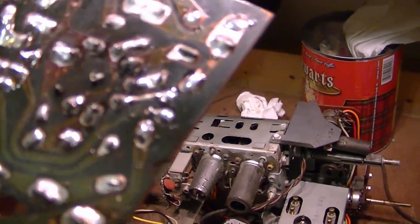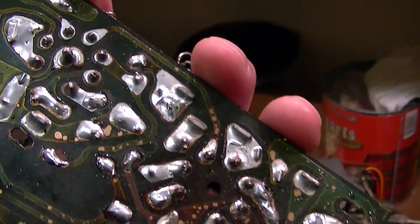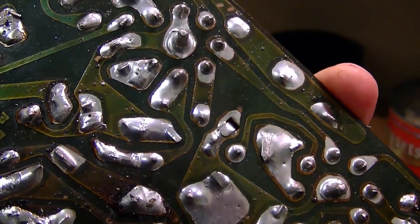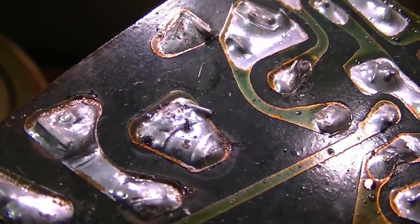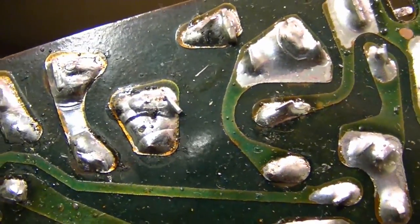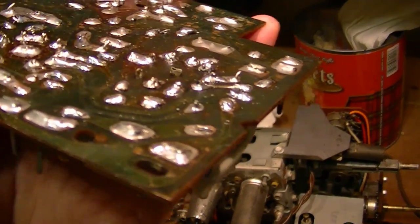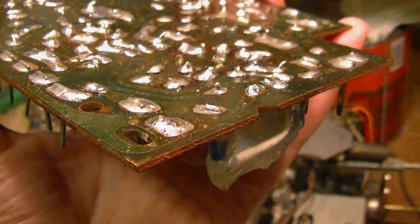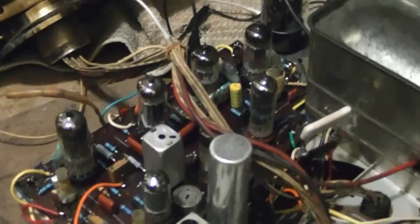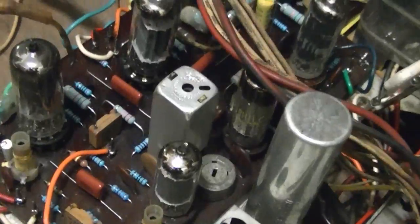As I'm sure I've said before, when you've got these boards out, check everything once, twice, three times. I'll go over this board before I put it back in. There's one that looks potentially bad too, right there — I think that's an original joint going to the coil, but I'll touch it up anyway. It all boiled down to: I screwed up — I forgot to solder that connection. I soldered the unsoldered connection and touched up a few others, then reinstalled the board. It was a bit easier because I just happened to have another one close by for reference.